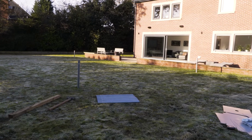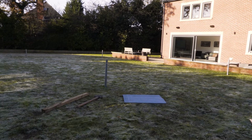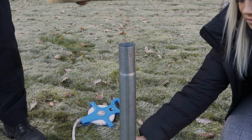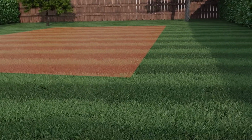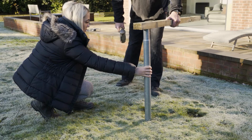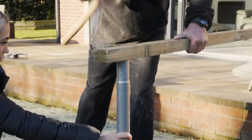To get started, we're first going to measure and position the foundation tubes of the four corners of your 20-foot wide polytunnel. At this stage, don't push them in too far, as we will be removing them. Based on where you have chosen to construct your polytunnel, choose a corner and position the first corner foundation tube. If the ground is hard, be sure to protect the swaged end of the foundation tube if hammering the tube